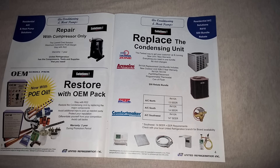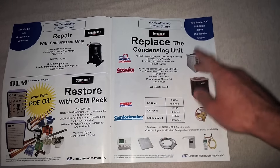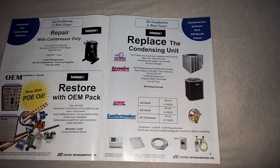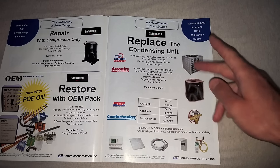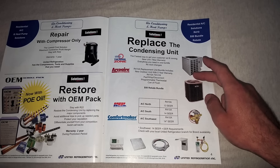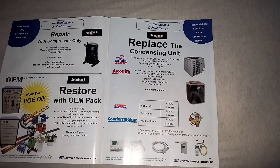Another scenario: I was talking to the parts guy at one of my supply houses about this whole 14-SEER scenario — how difficult it would be to just swap the outdoor unit and how well it would work. What he told me was some of the techs coming in there buying supplies are just buying the outdoor unit — whatever 14 SEER — assuming it was probably a 10-SEER system. And some are downsizing it a little bit, for instance from a three-ton originally down to a two-and-a-half ton. And he didn't mention that they would add a TXV. So I want to get your thoughts on whether you would do that too.